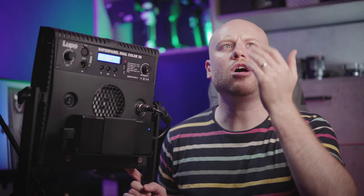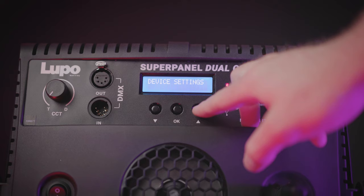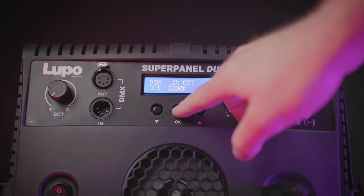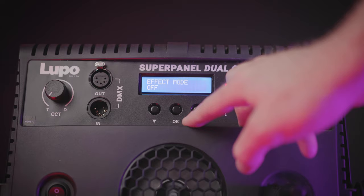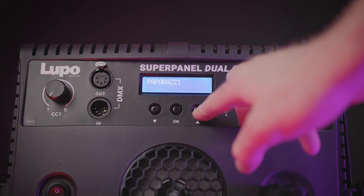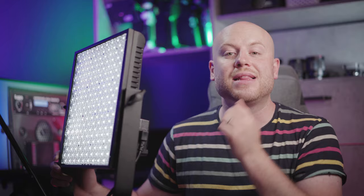The Super Panel is packed with a big noiseless fan and I would always recommend having it on. Even if you have the option to turn it off in the menu system, it's noiseless and won't be picked up even with a microphone close to it. This panel has a rating of 30,000 lux at 1 meter distance, so you will have all the light needed for your job. The menu settings allow you to control all functions like DMX input or manual mode. In manual mode you can control the CCT with exact Kelvin value, and effect modes like strobe, television effect, paparazzi, and lightning. All modes have deeper settings so you can really customize the light output. You can adjust the number of bulbs on the paparazzi effect, strobe frequency, or television frequency.